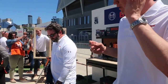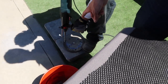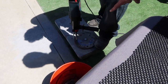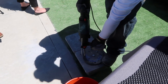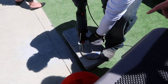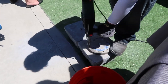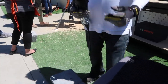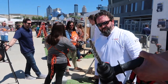The second thing that kills a bit is abrasion. When you drill through concrete multiple times you really wear down the carbide head. What we've got here to simulate multiple holes is an industrial abrasive grinding wheel. Joe is going to drill through this for about 15 seconds to simulate about a thousand holes in concrete — really wearing it down, trying to break down that carbide. You can see it's polished and the carbide is getting worn down a little bit, but the head is fully intact. That bit's fine.